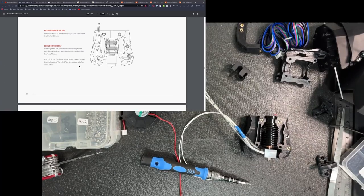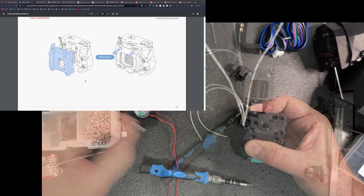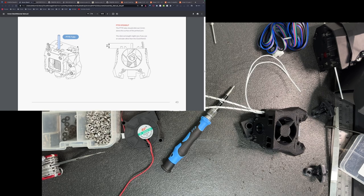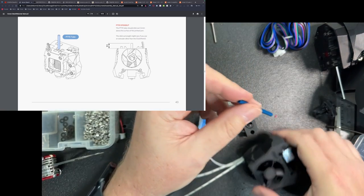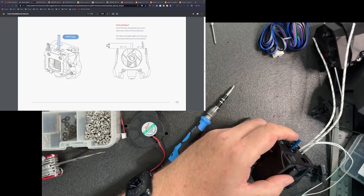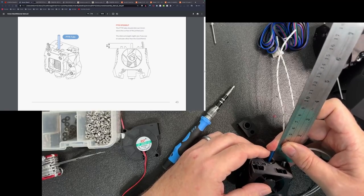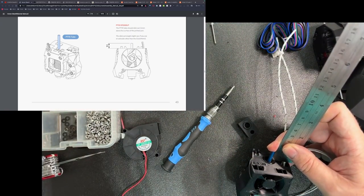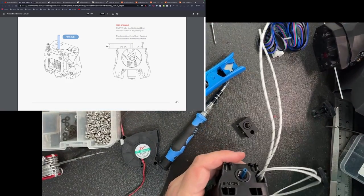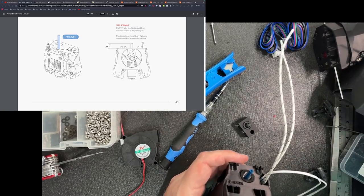I'm going to just keep going down to the next step. I have this back plate to hold it in and I need M3x16s — so I have that all put together. Now I need 11 millimeters sticking out of the PTFE tubing. Let me get some PTFE tube and measure all that out. I already have a small piece of PTFE tubing. I'll put that in — it needs to be up 11 millimeters. I'm going to just mark this off. Let me measure this again just to be on the safe side — it's right at about 11 millimeters. So I think that's good.